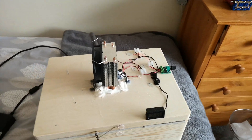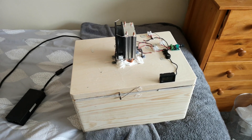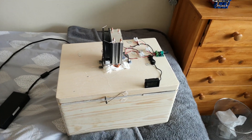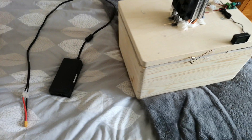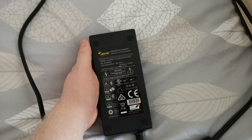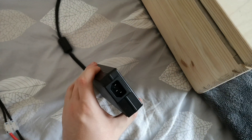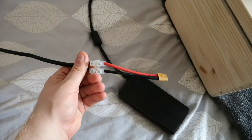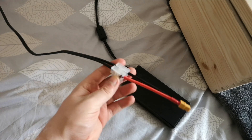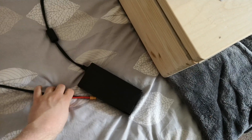One of the biggest elephants in the room was the power supply. The old cardboard box used a PC power supply — it worked, but not practical in the slightest with a big mess of wires. I found myself on Amazon and got a 150-watt, 12-volt at 12.5-amp power supply — just a big power brick. I got an XT60 connector and some 10 to 15-amp terminal blocks just so I can have a decent connection.